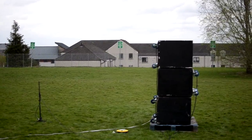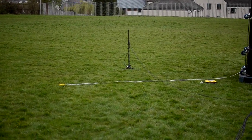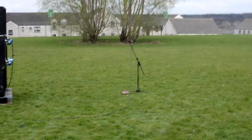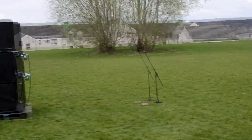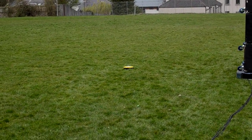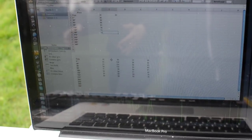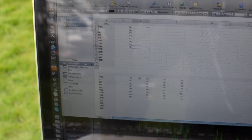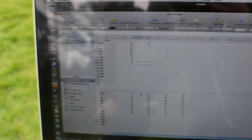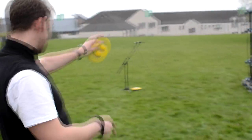We've got a little ambient noise interference but I don't think we'll have any problem at 40 and 60 Hz, and we've got a wind blocker on the microphone to cut down wind noise. With the three speakers running together and no delays applied, there's only a 1 dB difference front to back — so with no delays it's actually worse. We've now found the sweet spot: delayed by 22 milliseconds, giving us an amazing result. The front is at 90 dB and the rear at 72 dB — that's an 18 dB decrease, essentially halving the volume three times over at the back.